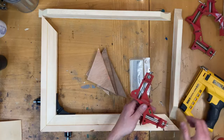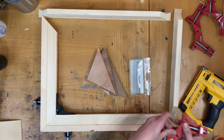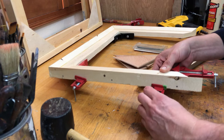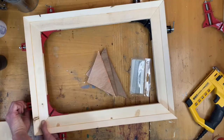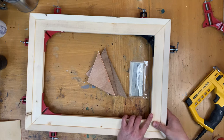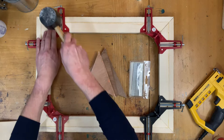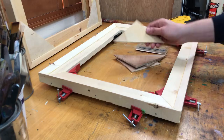Once aligned, tighten corners. If it is your first time building a frame, glue each corner as you apply the brace — otherwise the glue may dry before you even apply the brace. Do take your time aligning the corners properly. Canvas stretching is very hard on the corners and joints. After clamping all the corners, double-check that all the braces are tight and aligned. Then flip over the frame and check the back for alignment. Sometimes small adjustments are necessary, and rubber mallets are always perfect for small adjustments. Now it's time to apply the triangle braces.